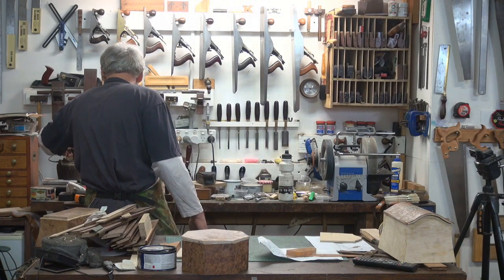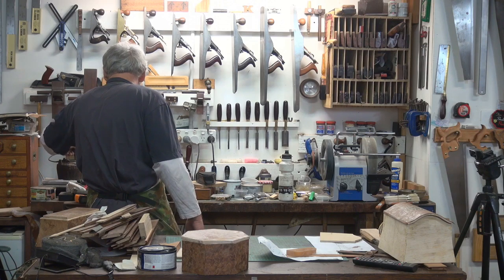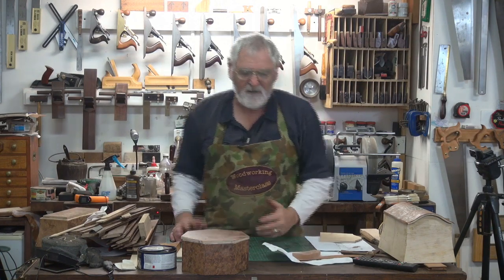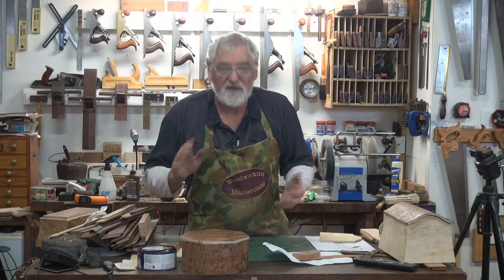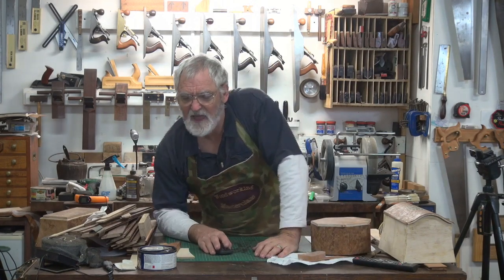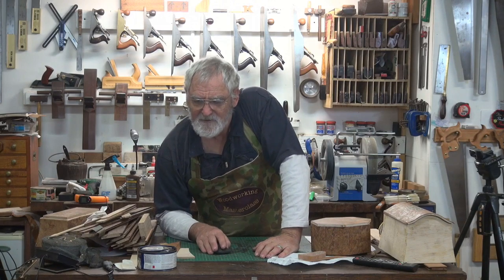The glue is nice. It's coming in just below 60. With hide glue, I'm happy. I like to keep it around the 70, but I'm happy if it's between 50 and 80 degrees. It's okay. All right, so Terry, thank you for that. I can move on now.